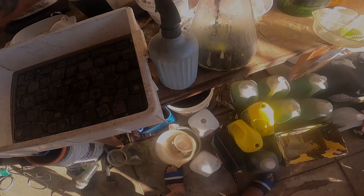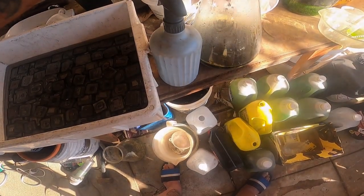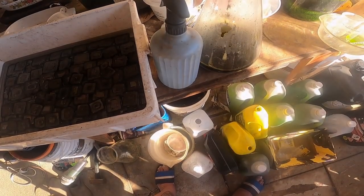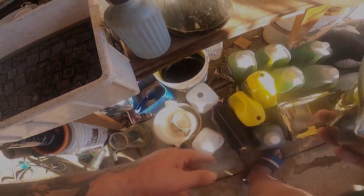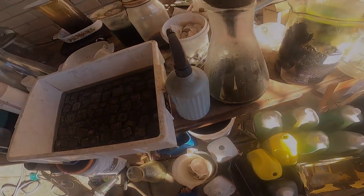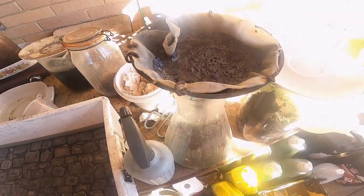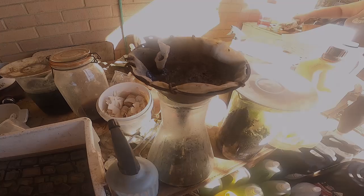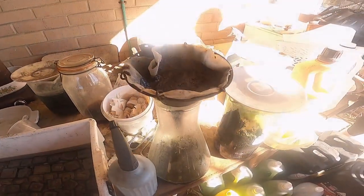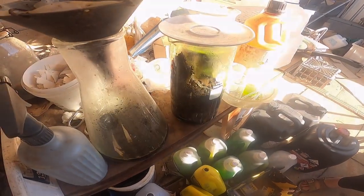The water solution just flows right through — if I was using cotton balls or filter paper I'd have to wait all day. I'll let that settle and then scoop it out with a spoon. I've got a little squeeze bottle with some water and I'll rinse it out thoroughly, then keep doing that until all of this is clear and I can inspect each one for any gold that's missed. If I don't see any gold then it's obviously all dissolved.